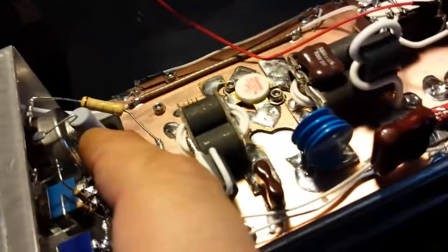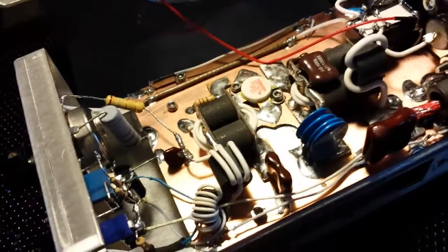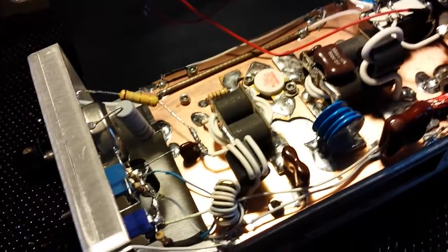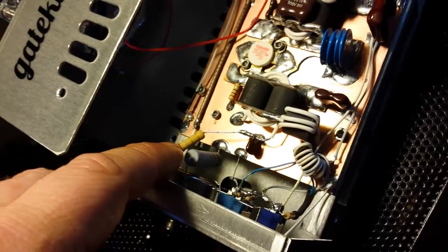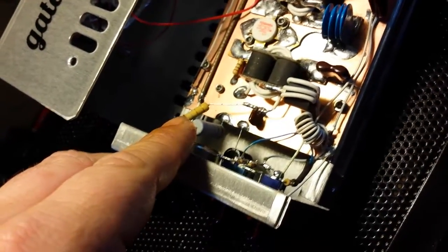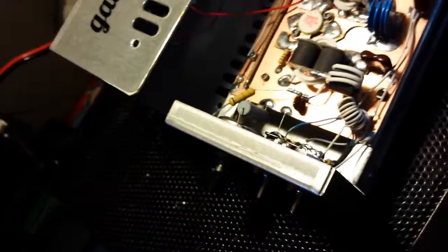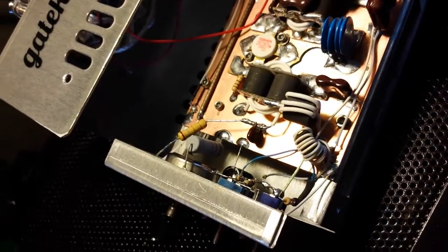Got your 5 watt resistor on the variable here. Like I say in all my other videos, I don't know how many times I've seen boxes where some people, they might be using an amp and it's too much for them. They need to turn that variable down, and the more you have that variable turned down, the more that 100 ohm is working, the more current that thing is limiting, and the hotter it's going to get. I have seen so many 2 watt resistors charred, blown, burnt.